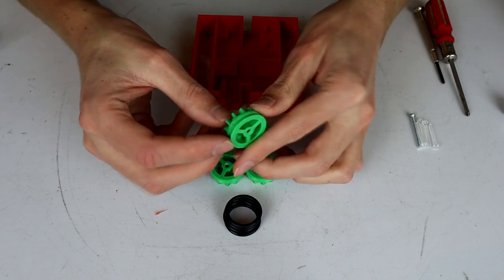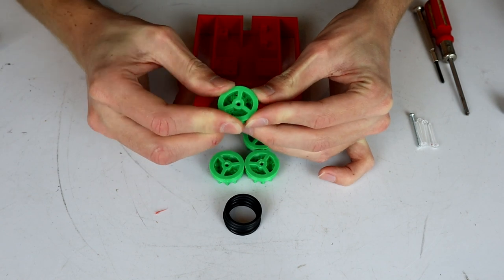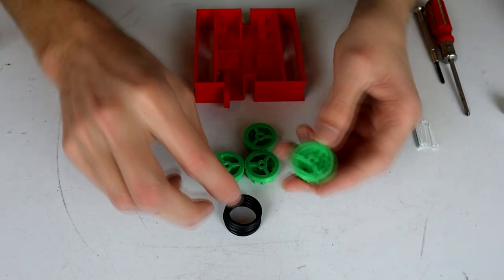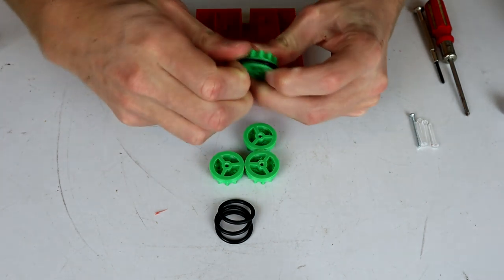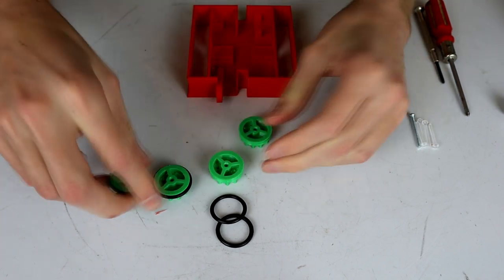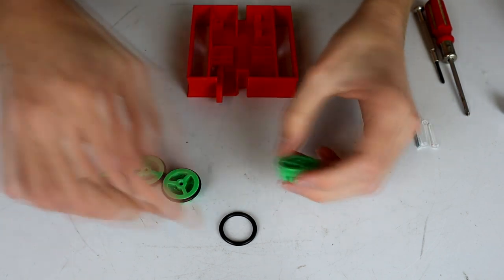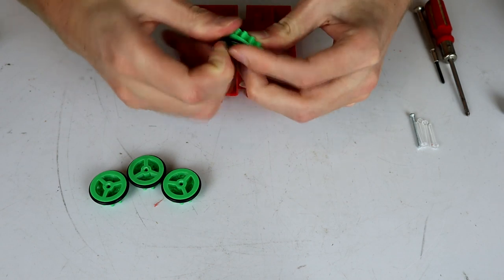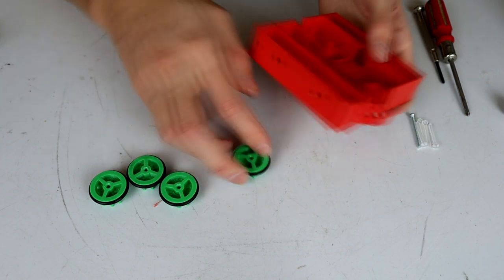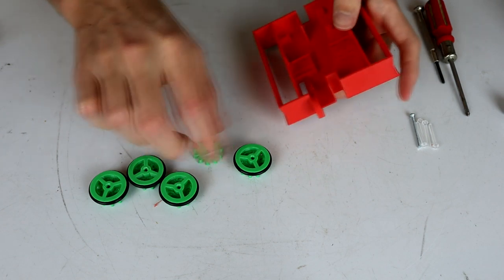So first of all, I've got these wheels, and these are actually printed in flexible PLA. So these are going to be quite impact resistant. Not that they need to be, because there are sidearms on here, but all of these, there's four of them, and we're just going to throw an O-ring around each of them. I think these are like 36 millimeter O-rings or something. I will have all of that information in the description down below, but all of these get an O-ring just like that. And these are all going to sit in here with gears on the N20 motor. So I'm gear driving this thing out to four wheels.